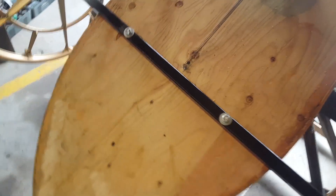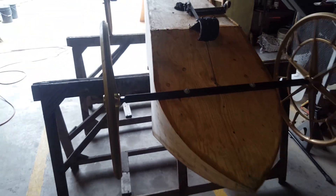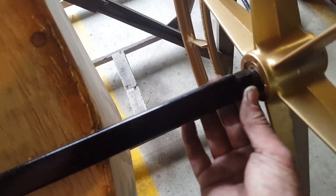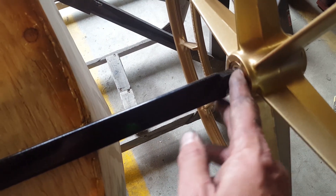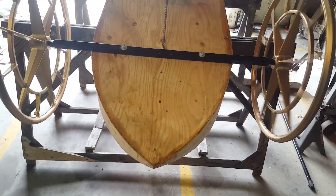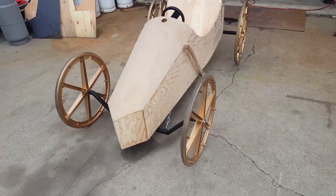That's the underside — straight axle in the back, dropped axle on the front. It's held on with a couple of bolts and one-inch tube. The fancy bits are the little machined coupling nuts that interface with the bearing so it doesn't drag. Same setup up front.